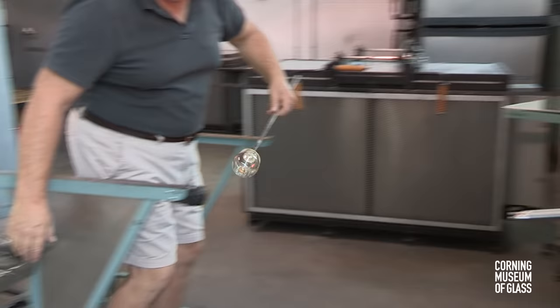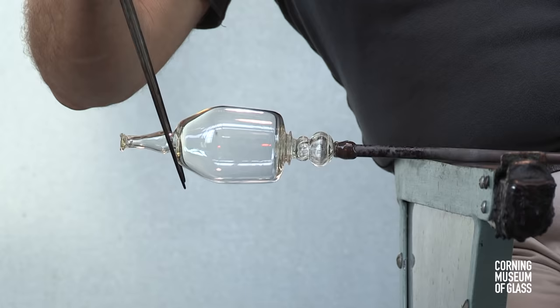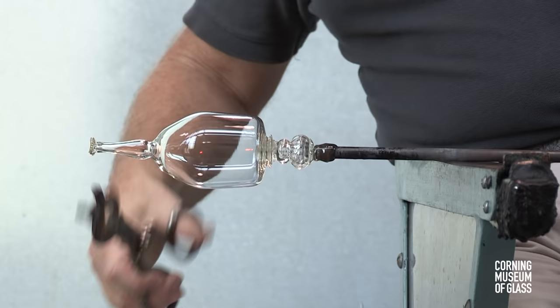The edge of goblets of this period are exceedingly thin, and a special lip thinning procedure is used. A flare is made, excess glass is pulled out very thin, a constriction is made, and the glass that was once thick is broken away.